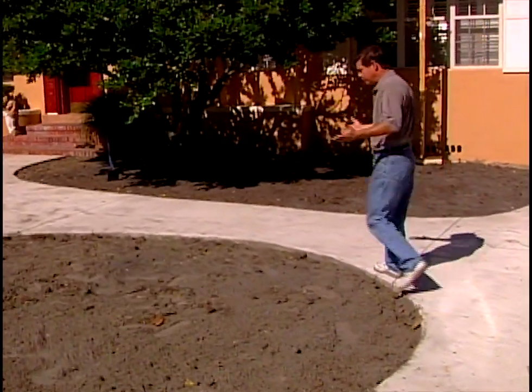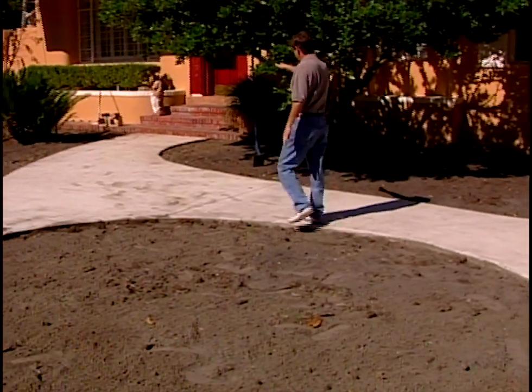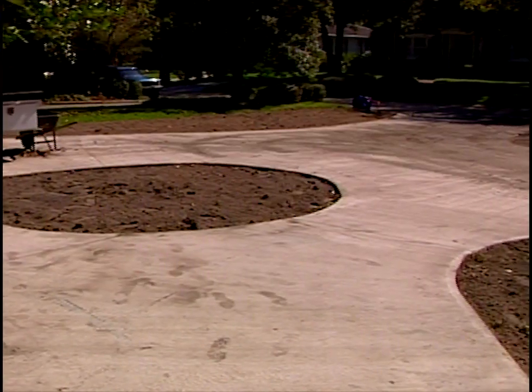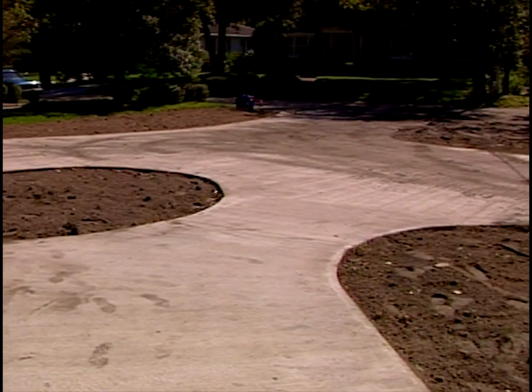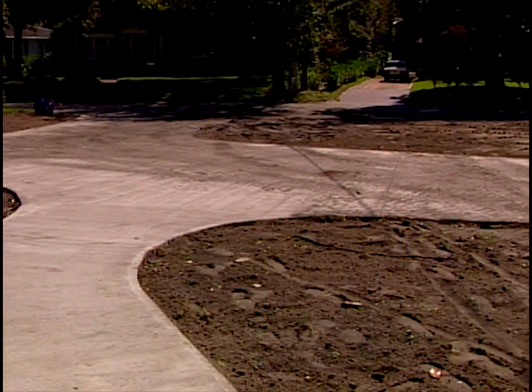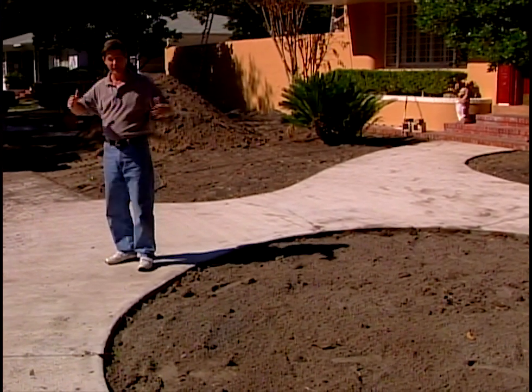A new design of a semi-circle driveway with a double entry here into the front door. So we look forward to changing the whole picture here as the driveway — the circular drive goes to the street. It was actually recessed down into the grade, so we're ending up a couple feet high at the road that we need to excavate.